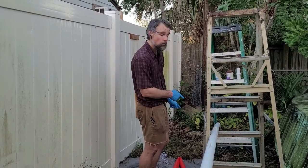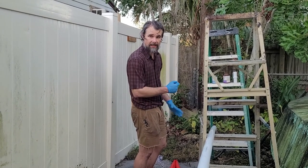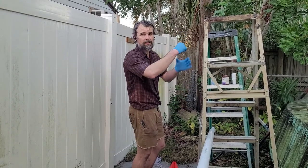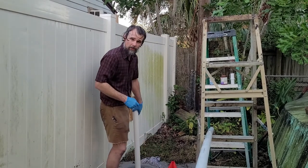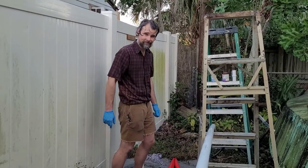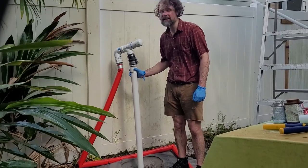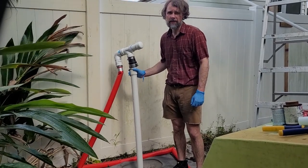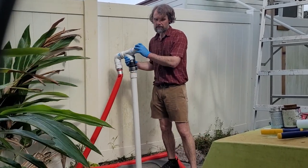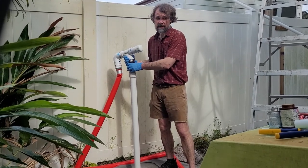I've got 2 4-foot well screens stacked with an inside coupler attached to a 10-foot pipe. We'll drop that down, hold it, glue another 10-foot on, drop it the rest of the way, and then pull the casing out, and the ground will collapse around the small pipe and hold it in place. Alright, so at this point we are about 28 feet in the ground, just a little short of that. We're hitting hard clay, but just like the other well we just drilled, it's deep enough to get the well screen 20 foot underground, so we'll be fine there.